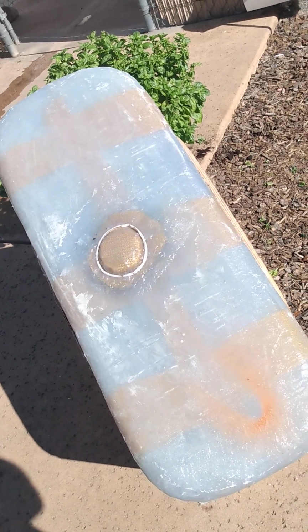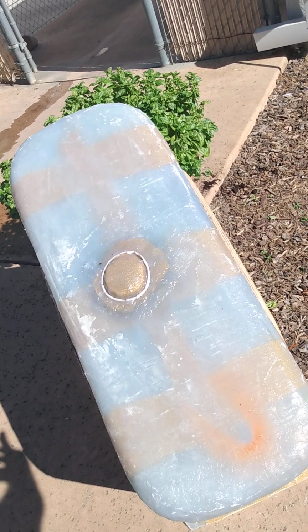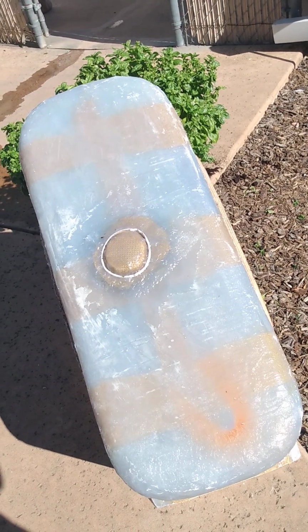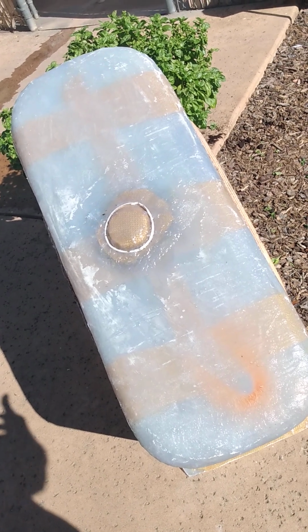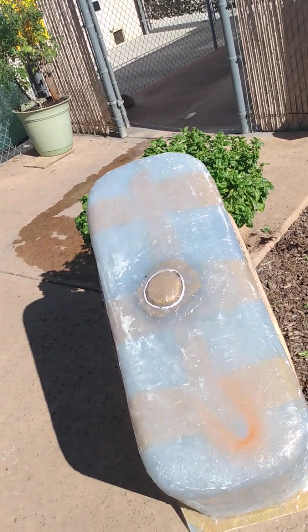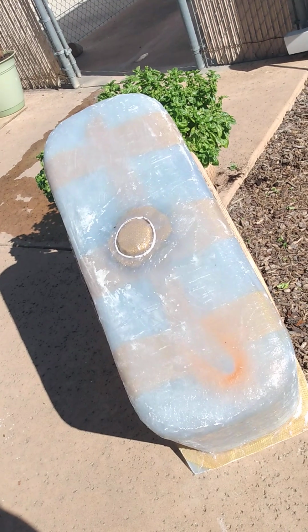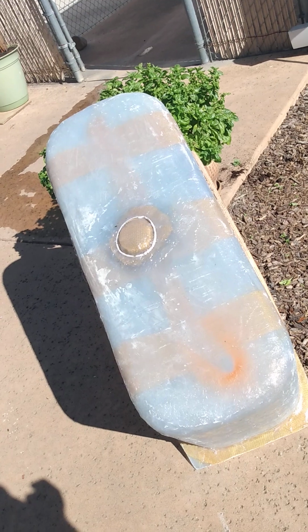And then on the plug, like I said, I fiberglassed it like I would glass a surfboard. Flat, smooth, clean, perfect. And so here's the trick. You can use the PVA, polyvinyl alcohol, which is sprayed on, and it's a water-based release agent, and it does work. But what I found out is that the tried and true method is to use the paste wax. It's got silicone in it. It's a mold release. I did like 8 coats, and what I'll say about that stuff is it is handwork.